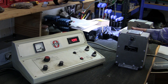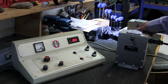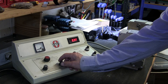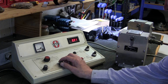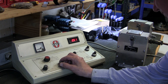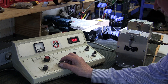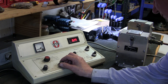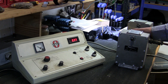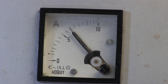1.5 volts to 5 volts for zero to full. Now switch the drive on and we can position it with the drive. You see the amps go up to 6 amp current limit when it hits the end stops, and forcing the actuator back you can see the current shoot up to try to hold the position.